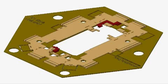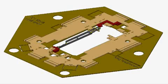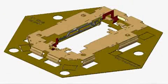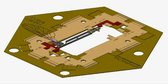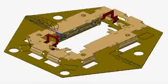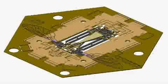Similar linkages on the interior are connected to each of Mobi's components, causing them to move when the plates are separated. Here, the side of the airframe undergoes simple rotation. More complex motions can be created by combining multiple interior linkages. Here, 2 linkages form a parallelogram that keeps the wing level. Mobi uses 9 interior linkages in total for three-dimensional assembly.